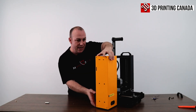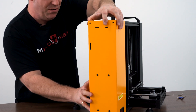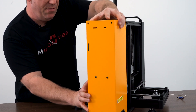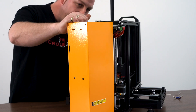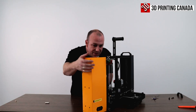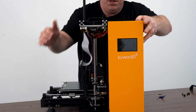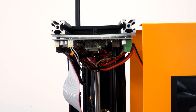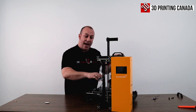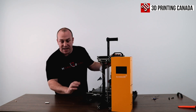Just to give you a look under the hood: the side panel slides off easily. You can unplug your screen cable to give yourself more room to work. They left you all kinds of room in there and it's really easy to access things. I'm really impressed with this printer — the dual lead screw, anti-backlash nuts, smooth rods, BL-Touch. They've really kept everything nice and neat and tidy.